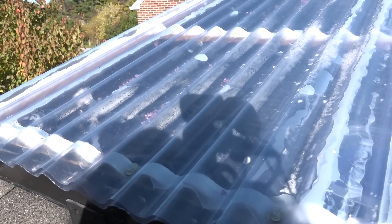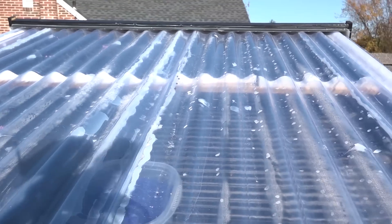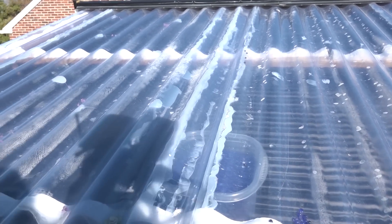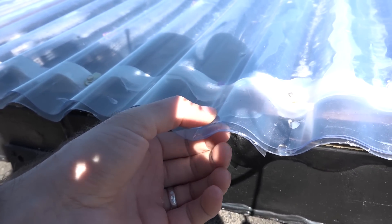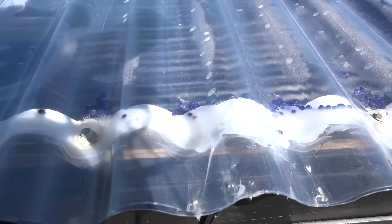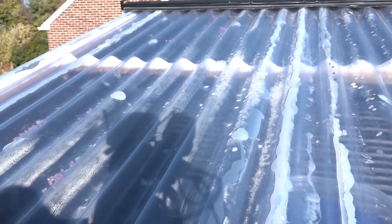Up here is the solar heater — it's a heater designed for swimming pools, a solar heater for swimming pools that I put inside this polycarbonate panel case. I made two layers of polycarbonate panels with a little air gap in between them just to help insulate. I also put silica gel between the two layers as a desiccant to absorb any moisture trapped between the panels, and also placed silica gel inside to absorb any moisture so that condensation doesn't happen too badly inside.